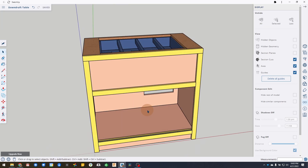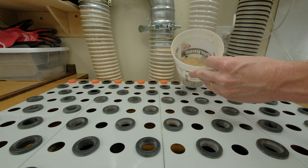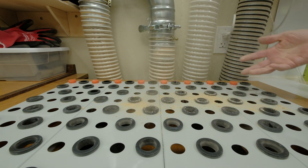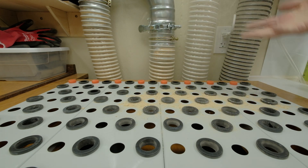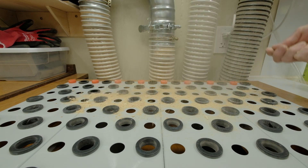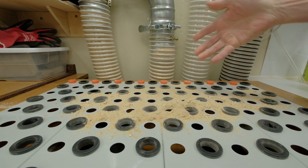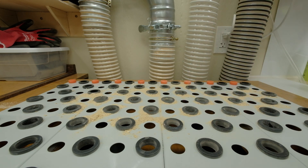The last thing I'll do before wrapping up is turn on the downdraft table and demonstrate the airflow. I've scooped a bunch of dust out of the separator on my shop vac — really light, fine, fluffy dust. Let me throw a little bit up into the air in front of it. There's just dust floating all around in the air above the downdraft. Now I'll turn on the downdraft and throw some more dust up into the air. Hopefully you can see — nothing is floating around at all. Everything disappears straight down into the table. Not everything goes through the holes, but it's all sucked down to the table, and none of it flies up when you mess around with it.